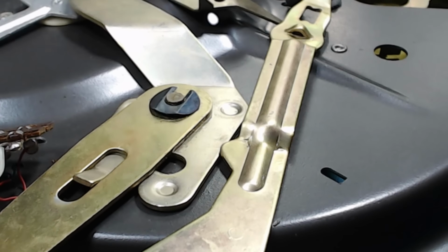Next thing to do is put the motor in. Here's the motor, and I was going to pull it apart, just clean up the bearing surface here on the shaft, just make sure there was no burnt oil on it, but this is still spinning okay, and the pads inside are still moist. So all I'm going to do is replenish the oil in those little felt pads, and that'll keep going for another 50 years.